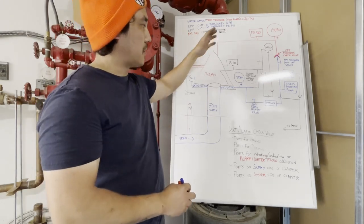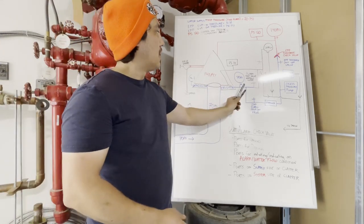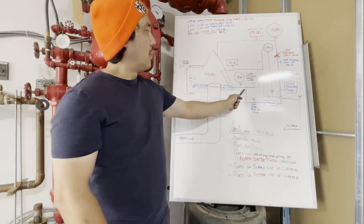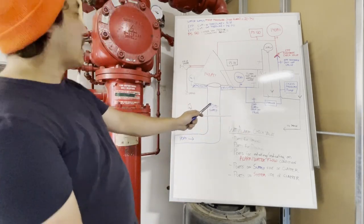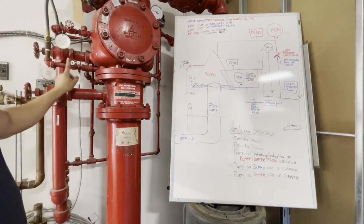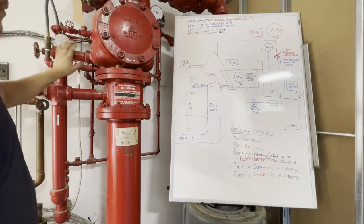We have pressure on the system, all our valves are open, everything's in its normal position. That alarm test valve is closed, so we're going to ignore that side for now. Coming down this way, we've got another valve — in this case it is a half-inch composition disc globe valve. The one on the back side here is the alarm test; we're going to go over that. We've got an excess pressure pump supply shutoff valve.